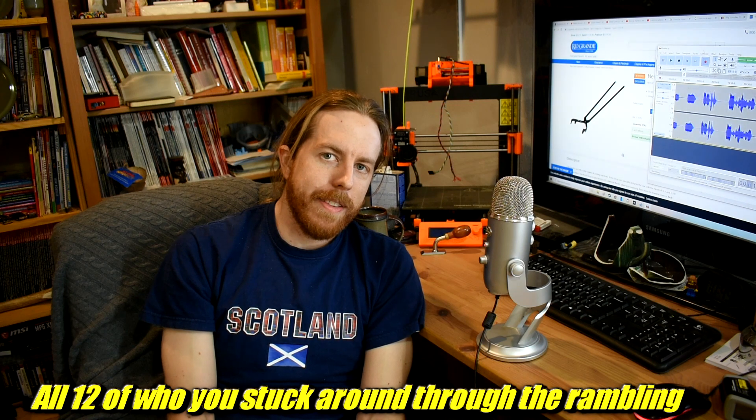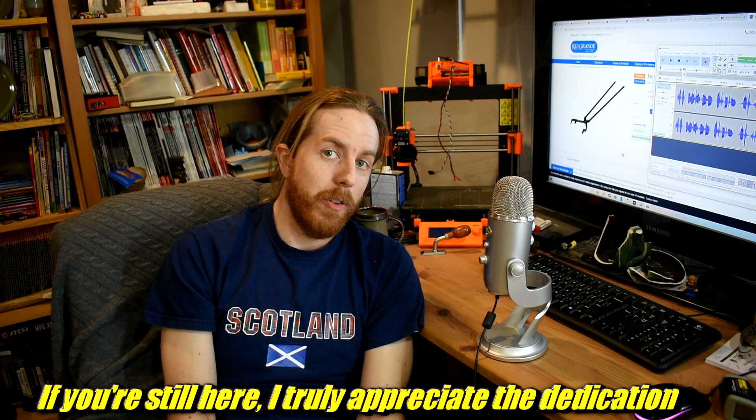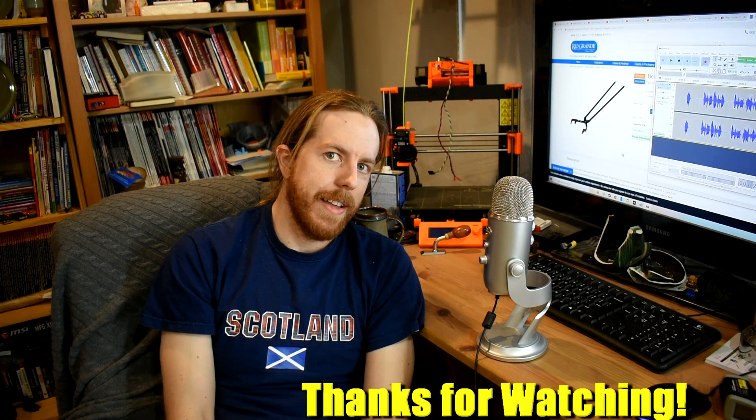So where do we go from here? I'm not going to tell you what my next video is because every time I make a plan everything goes wrong. You'll probably see these tongs in action in the future when I do more castings for the Gingery project — no ETA on that. I was thinking: I built that new gas kiln with a thermocouple on it, so I could narrow in on a pouring temperature. Before, it was just let it melt, let it get a little hotter, then pour — not very scientific. I might actually settle on a pouring temperature. Pour something at the right temperature, pour something at 200 degrees above that — that sounds like a fun test.